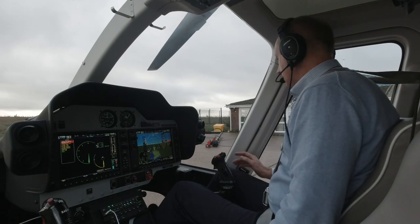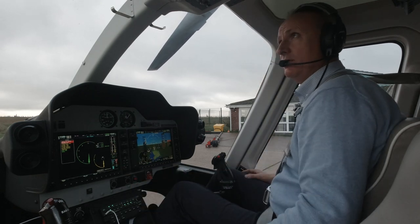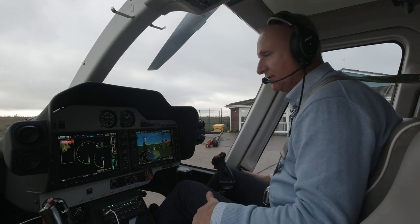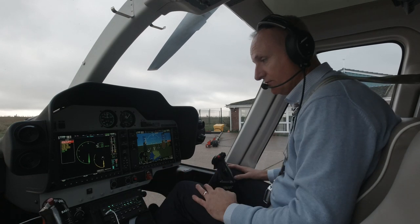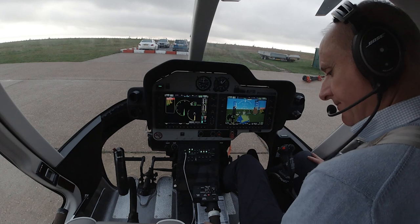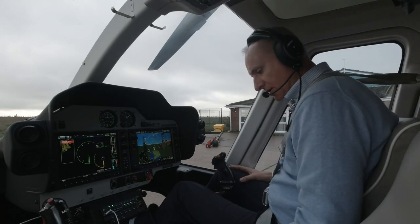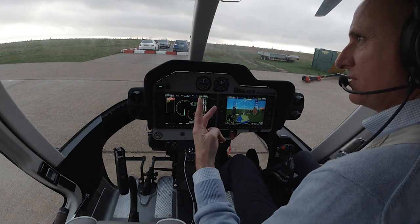Okay, we are now ready to start. The area is clear. We have 25.1 volts, which is sufficient for starting the 407 — we need 24. Battery is off because we are on ground power. We have the captions up we would expect to see. We start the 407 in idle. If you go to idle and exceed more than 60 seconds before you start, you will need to go back to off and back to idle to reset, because it just thinks you have gotten started up. So we just check the throttle — in to idle, to fly, to maximum, back to idle, back to off — just checking that the freedom of throttle is good. The area is clear, we have sufficient voltage, so we go to idle. Boost pumps are on — that will clear the captions for the two boost pumps and the transfer pumps, four pumps in total. Now we are going to hit the start, hold for two seconds and let go.